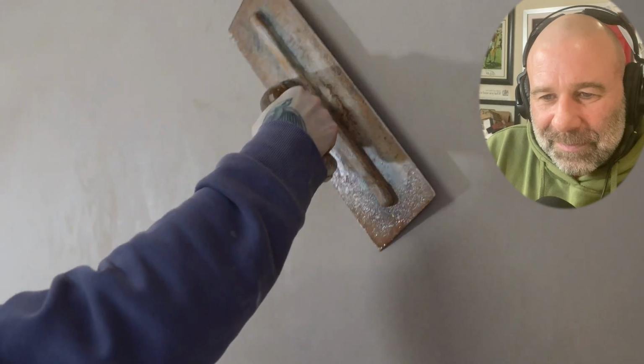That was good. The noise, there was no dragging. It was smooth. Yeah. Your trowel position then was perfect. It was the same distance across the wall. Carry on. It wasn't dragging. Okay. It was nice. It was controlled. It was slow, because you don't have to be fast. You don't have to speed through it. That last one was perfect.